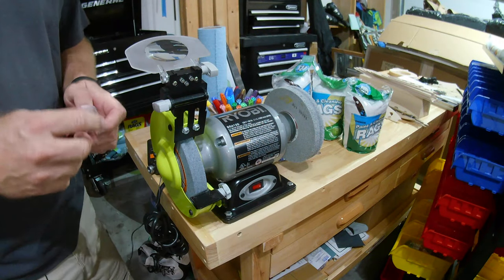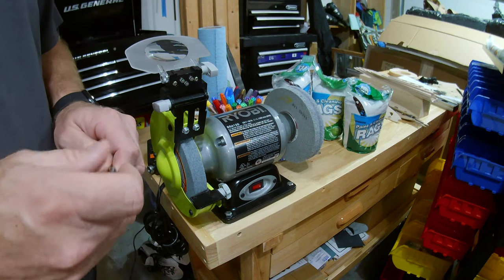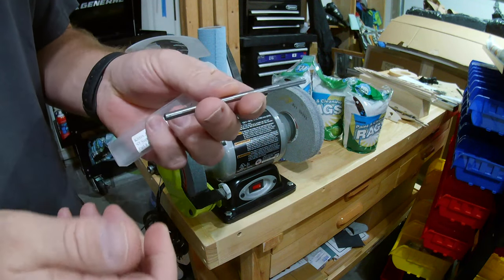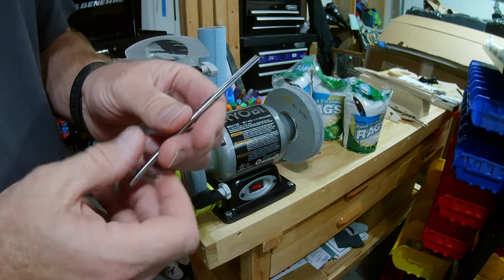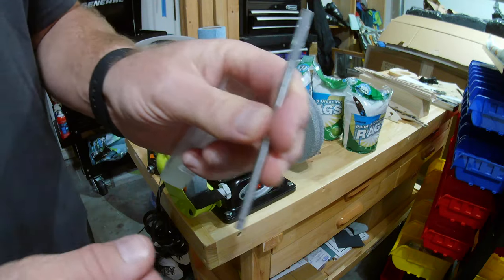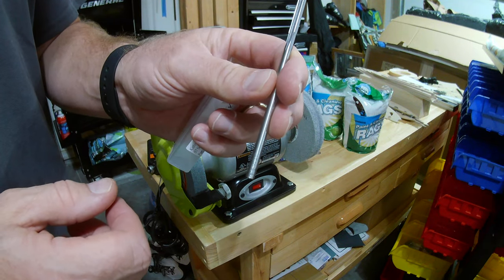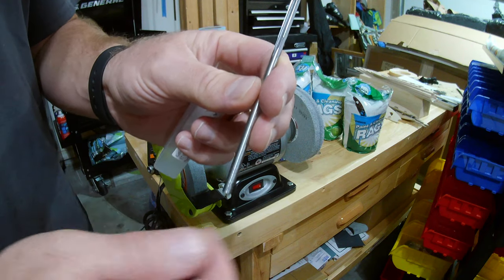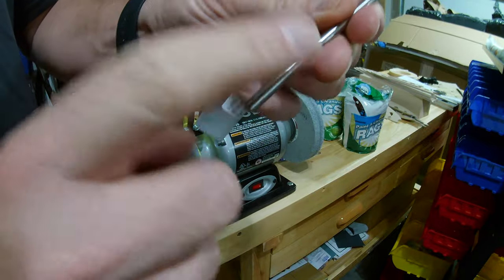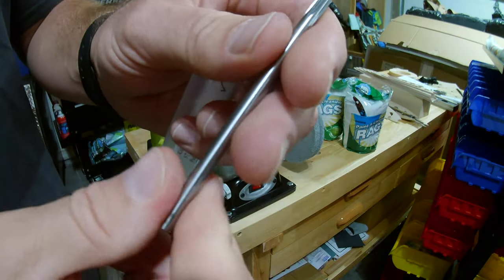Okay, so today we're going to talk about reaming, and basically the first thing the manual said was to pull out these two reamers for the horizontal stabilizer. This one was used in the aft spar, I guess you would call it, for the horizontal stabilizer. There's some small holes that went through that, and that was relatively easy. I just hooked up a T-handle and turned it through, and it was real easy.